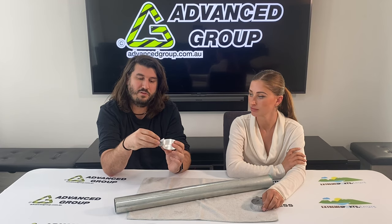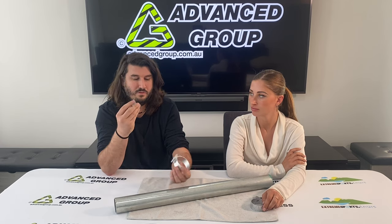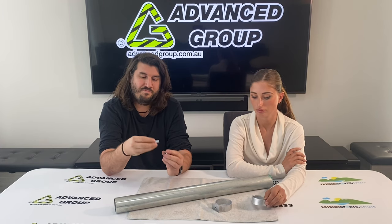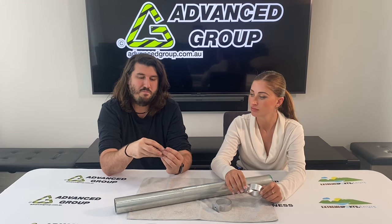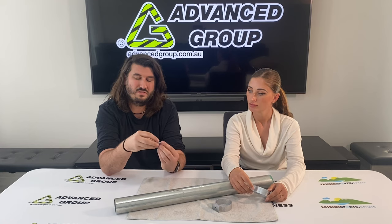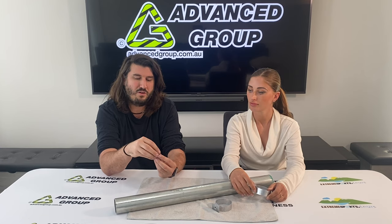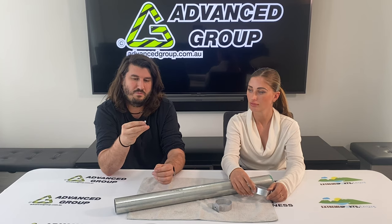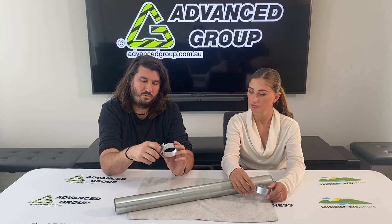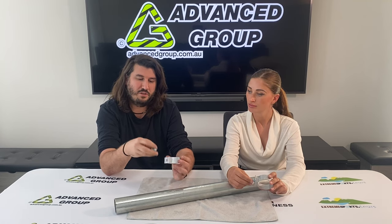The thread needs to be pretty strong to do up the bolt very tight without pulling out the thread, because this is steel and that's aluminium. But don't be fooled by it being aluminium — it's not soft at all. It's a very high temper grade. The bolts and washers are mostly just zinc coated. You can get stainless steel washers. The bolts will very rarely come in hot dip galvanised, but they're less common. Hot dip gal bolts are more awkward and difficult to screw into the thread, and they're much more expensive and a little bit more rare. So mostly these are zinc, which is fine for 99% of applications.